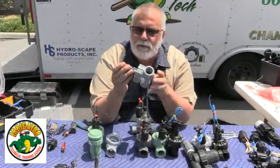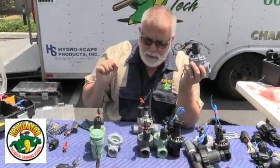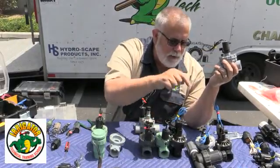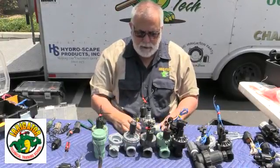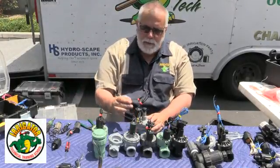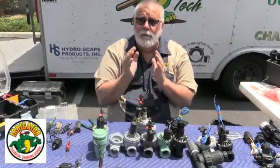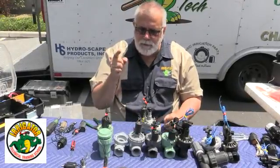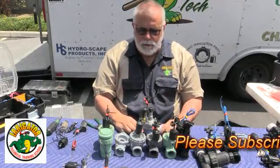So if I have an Irritrol 811 solenoid, I can take that 811 solenoid and put it on an Orbit valve, HIT valve, Water Master valve, Standard Orbit, Hydro Rain valve, Hydraulic valve, or a Champion valve. It's kind of nice that all these manufacturers have somehow gotten together and are using the same solenoid. It might say Orbit or HIT molded into the solenoid itself, but it's all interchangeable. So if you go into your local store and they say they don't have what you need, you now know that you can use an Orbit, Hydro Rain, Irritrol, or HIT — any of these solenoids will be interchangeable, and it works really well.